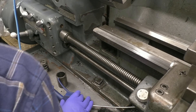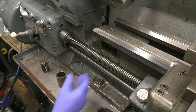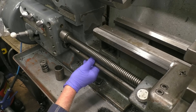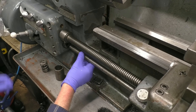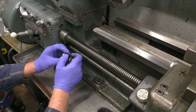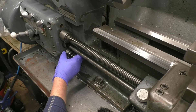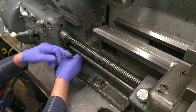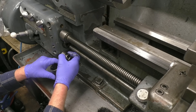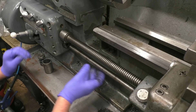I've got a problem with my trusty Harrison 140. I was machining the other night and the power feed stopped working. There's a clutch mechanism in here — the feed shaft wasn't going round. I've pulled this apart and what's in here is like a sort of spring, like a dog clutch. So what happens is if you try and overrun the travel of the machine, or the machine crashes and the shaft is still spinning, it's got a ratchet on there and it just jumps to stop causing any more damage. So it was actually doing its job, what it's supposed to do.